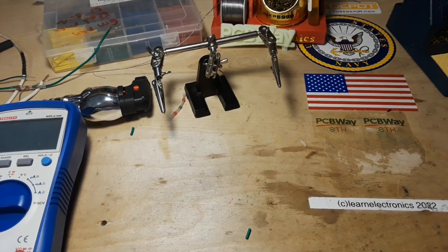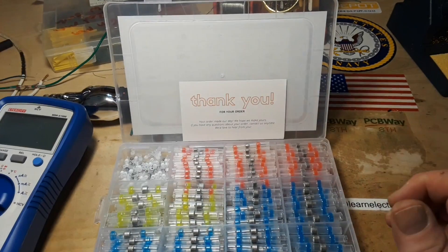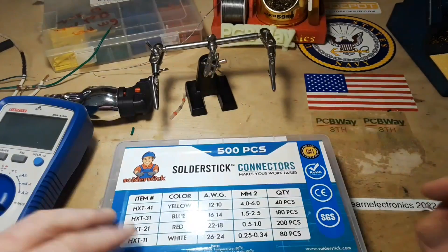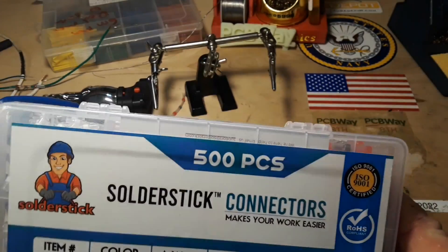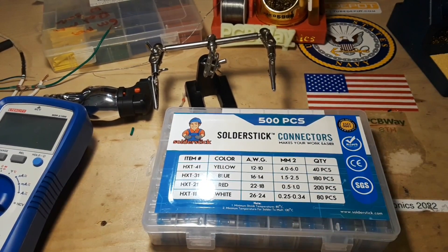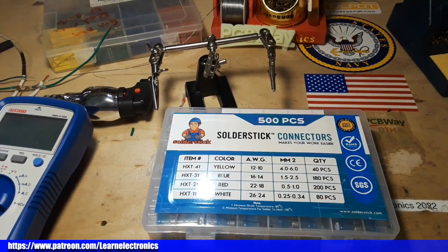I think they're a winner. Solder Stick sent this out to us free of charge for our consideration, and my consideration says this is a must-get for your toolbox. It's less than half the time of doing a solder joint plus heat shrink, and it is at least as strong and electrically matched resistance-wise — so fantastic. This kit lists on their website for about $25 — I'll put a link down below. It'll take you from 10 gauge all the way down to 24 gauge and there's 500 pieces in there. Check out solderstick.com for hints on how to use it. Thanks for watching — if you enjoyed this, give me a thumbs up, feel free to comment, share, and don't forget to subscribe. Big thanks to Ryan at Solder Stick, and thanks to the patrons and all of you guys out there. That's it, I'm out — peace.